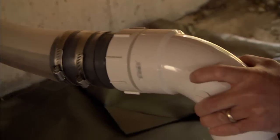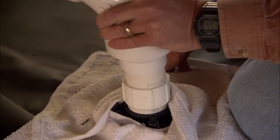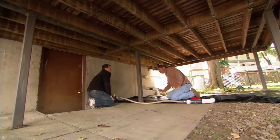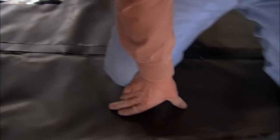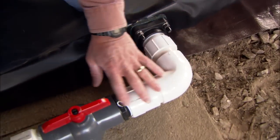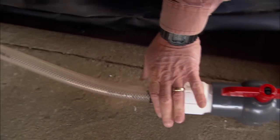I'm going to glue up the connection from the flexible pipe to the top of the pillow. Now we've got all our connections made to get the water into the water pillow, and now we've got to think about getting it out. Over here, we have a connection on the side of the pillow and it comes out to a ball valve so we can shut it on and off.